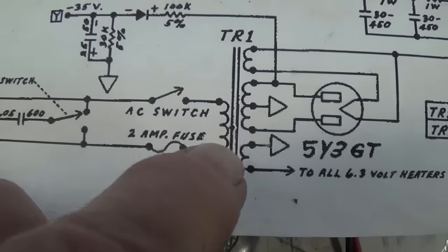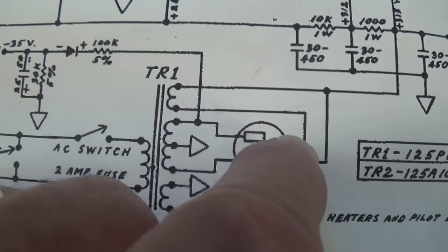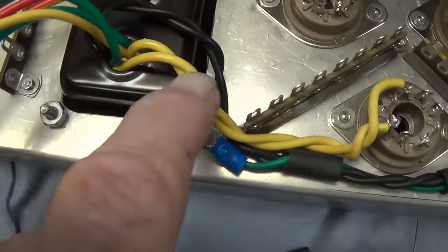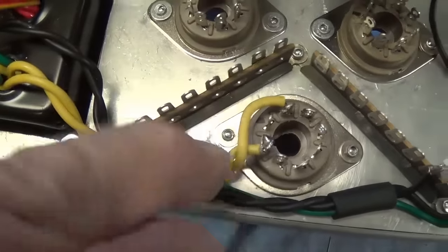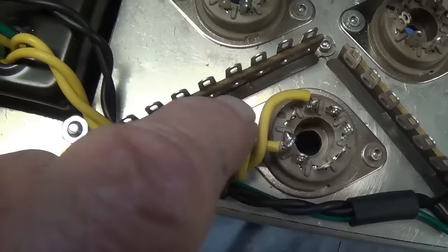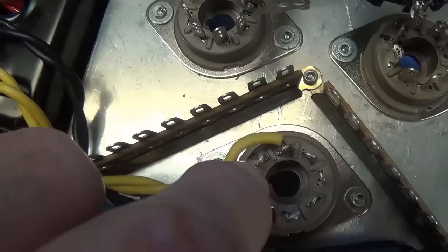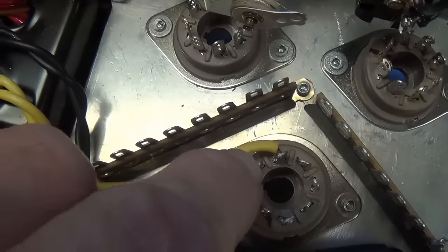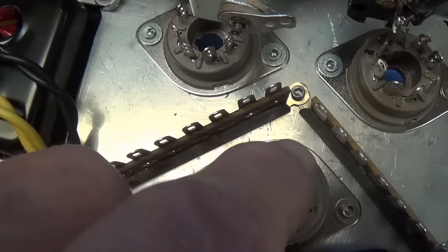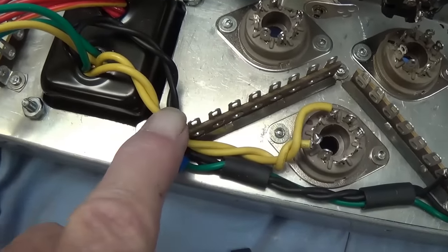The white wire, which is the return, goes to this lug and goes to the other primary wire. The green chassis ground comes down here, goes through the conduit, and is securely bolted with zinc-plated hardware over here to one of the transformer bolts. Now that our primary circuit is wired, let's start with our rectifier wiring - this is the filament wiring, which are pins 2 and 8. You need to check your color code on your transformer, but it's almost always the yellow wires that are the 5-volt leads. You twist them to neutralize each other's electromagnetic fields, and then solder them to pin 2 and pin 8.